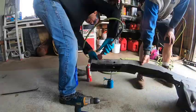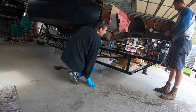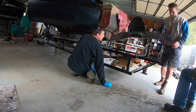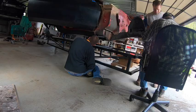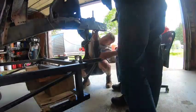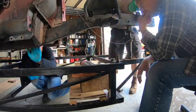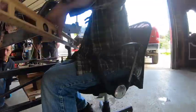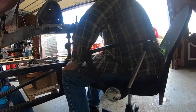It's nice to finally put these frame rails up on the car and fit them after what seems like a really long process of preparing the frame rails and floorboards — a real light-at-the-end-of-the-tunnel moment. We've got a chassis jig we built — a chassis table based on the factory service manual measurements. The service manual is really helpful because it has pretty much every measurement you need. The car has reference holes built into the bottom of the frame rails and body that you use for measuring, and we've confirmed this car is straight from the firewall back — cross-measured side to side and up and down.